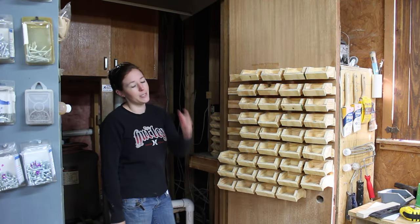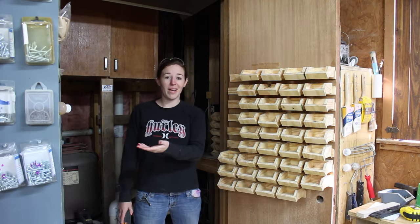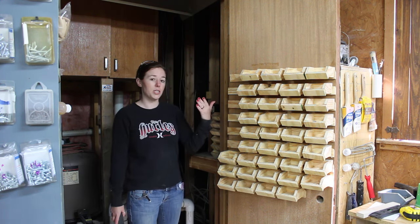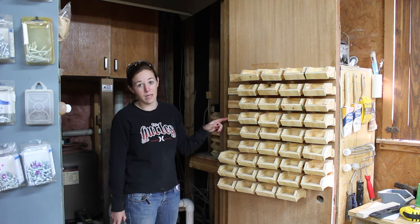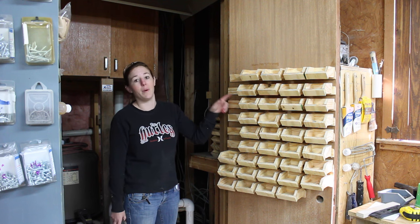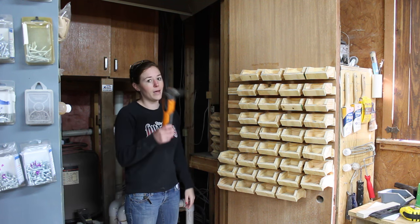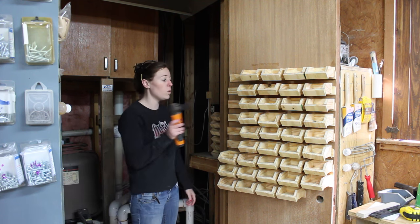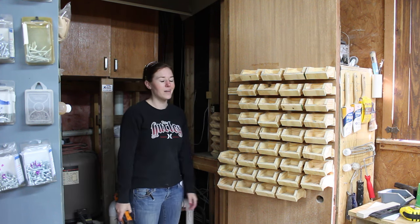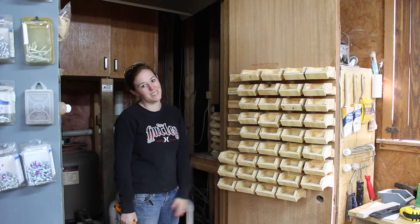Silly mistake — especially considering I did something similar on that door and compensated for it. I forgot to compensate for this door jamb piece. Whenever I'm trying to shut the door, this piece is running into the cleats and won't allow it to shut. I should have set these back by half an inch. I forgot to, so now I'm going to come in with a multi-tool and just nick off half an inch on each one of these. It's not hard, it's just frustrating overlooking something so simple.